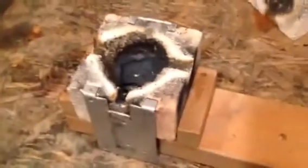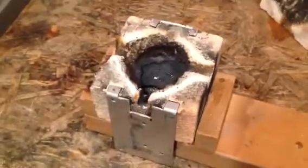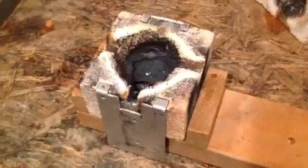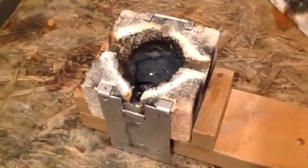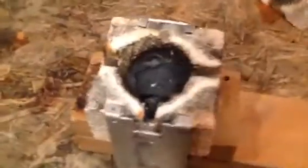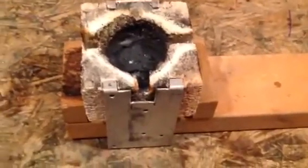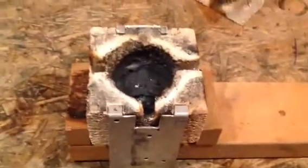This worked really well for the second iron casting. I really didn't have any problems — the wood just smoked a little bit, but otherwise it was pretty much just like pouring soup out of a ladle. It just went really smoothly. The iron was completely liquefied, and it provided a nice handle so that I didn't burn myself. Another thing that happened during the first iron casting was I almost burned myself holding the electrode grips.